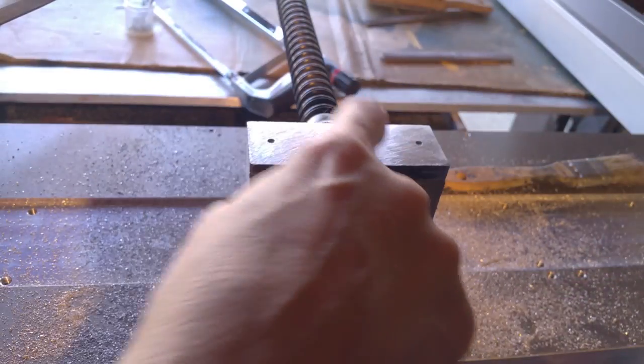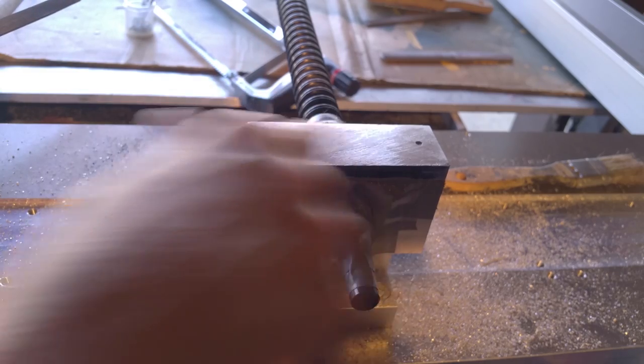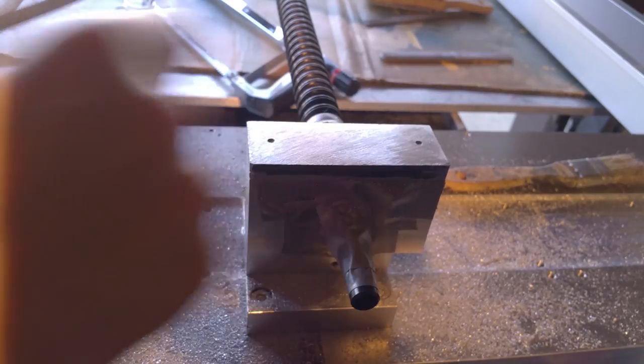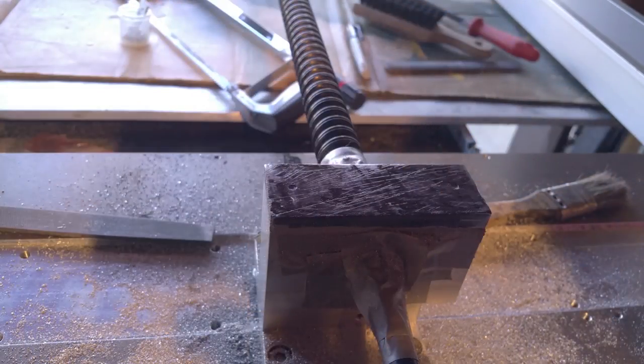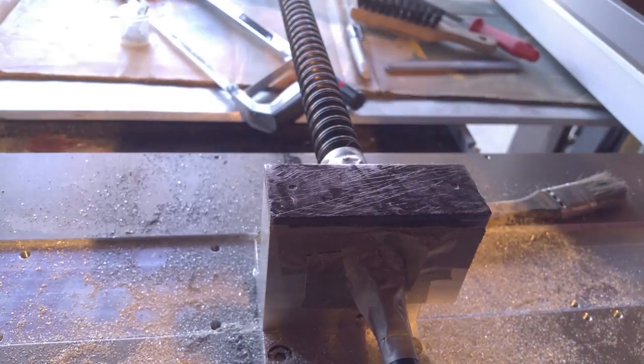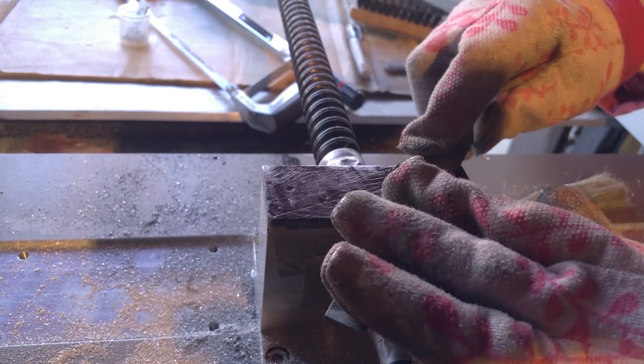Here is no longer the deepest scratch. It's this one from galling. These two are from galling from not cleaning the file. And sometimes a curl of metal will go under and kind of cut into itself. And so just for kicks, I covered this up with marker. And I'm going to take the medium fine file. And let's see how bad this is. This should be interesting.